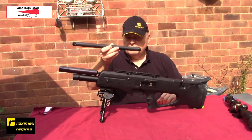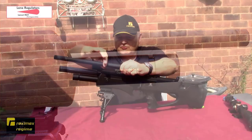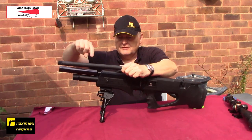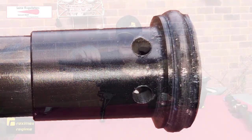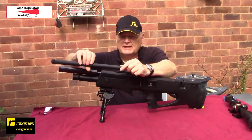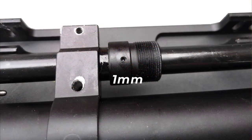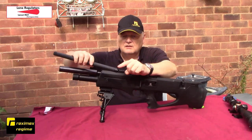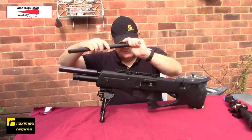It comes as standard with a shroud, so you unscrew the shroud and pull it off. At the end of the barrel there's a T-piece that will also need unscrewing. When that's off, you can unscrew the three 1mm Allen nuts on top of the end of the shroud at the rear end, and all that can come off.